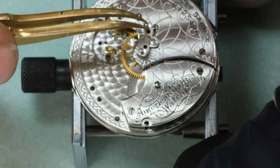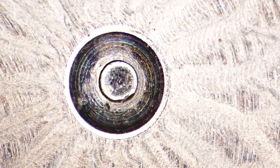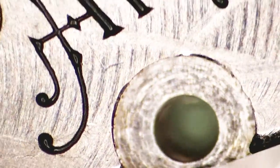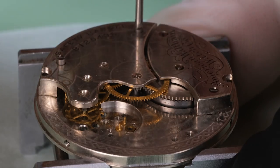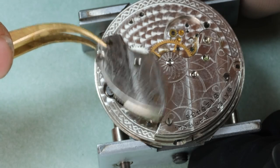But before talking more about Dennison, let's have a look at the reasons this watch was not running. This is really, really old lubrication that's completely dried up and even crystallized to some extent, so that creates more of a bond than lubrication. You could see that once we took out the pallet fork, the watch train actually started running down. So as long as the pivots are not damaged by this, this is actually a good thing — it means we probably just need to service the watch.